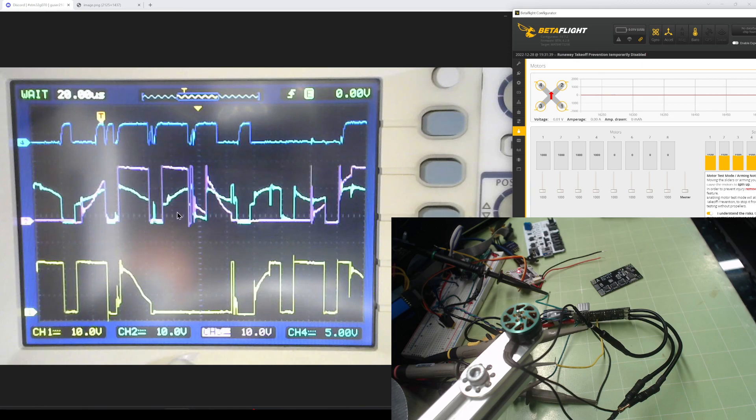At this stage, still pretty easy to detect. The easiest one to detect is always a rising edge, because after the commutation event you start checking to see when it's coming up. As soon as you get the first pulse going up, you can be sure that the floating phase has crossed the virtual ground — so you have a zero crossing event. Then you commutate and go to your next phase and check whatever you need to check. But on this end, this is where it becomes tricky.